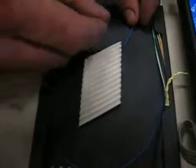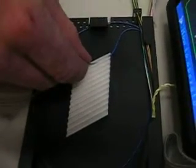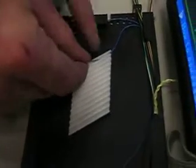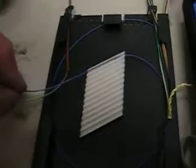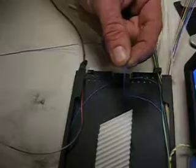What we're going to do is go around the tray at least one time, and notice here I'm leaving myself a little bit of extra slack in case the first splice doesn't work out. We could always have room to strip it and go for splice number two or even three if need be. So right here there's plenty of slack — you can see in the middle is where it's going to get fused. So we can cut this off down here and go ahead and strip what we need.